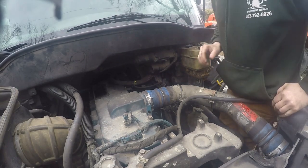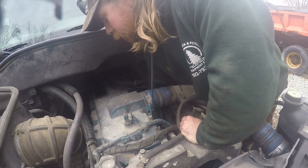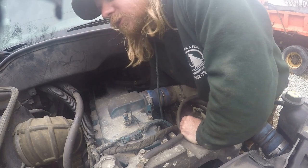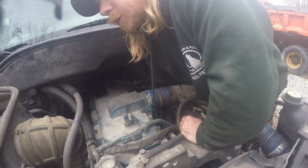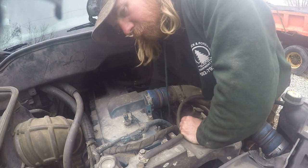But what happened was, I guess just over time, the fuel lines just got rusted. I think it's a 2006 or something, Bandit. That's what happened to it. It just, fuel line rusted. So I finally got new fuel lines on it, put a new fuel filter in the end line, changed the fuel filter on it, and finally got it fixed. Had to put a couple bolts in the shroud and stuff. Wasn't nothing major.